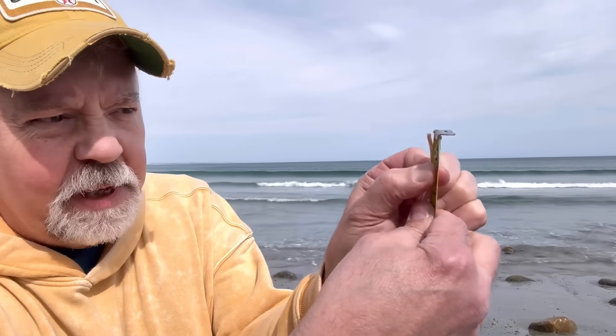I'll show you the feed point and how we'll do it. As I was saying earlier, measure an extra inch — we got an inch here. Clip it off right there. Now I'm going to take — this is 16 gauge wire, the 16 mark right there — that one inch and strip it off. I'll put this in my pocket so I don't pollute the beach. Then I'm just going to twist these around, so this will be what goes to my feed point. Just twist it around like that. This is a down and dirty, quick, easy antenna. Yes, you can put connectors on, but that's not what we're doing today. We're hacking and whacking and having fun.